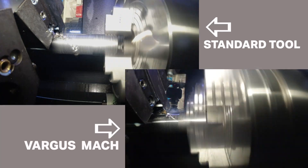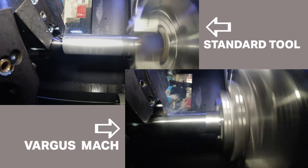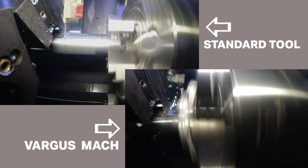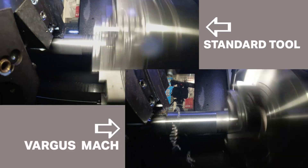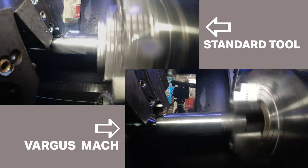We've managed to change the grade — it's a new substrate, new grade. It's got a completely new surface finish on it, again reinforcing the cutting edge, and we've improved the profile design for a better surface finish than the standard insert.